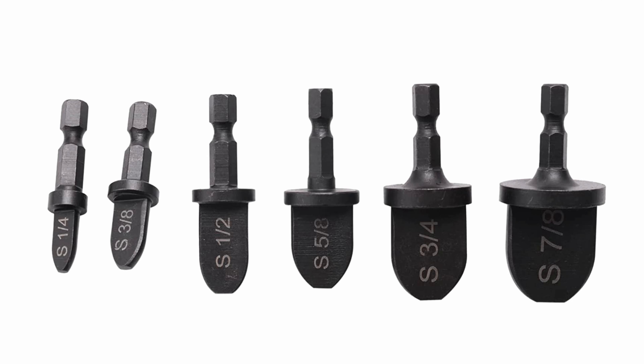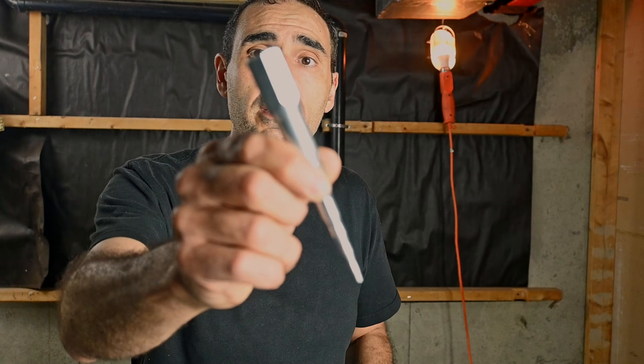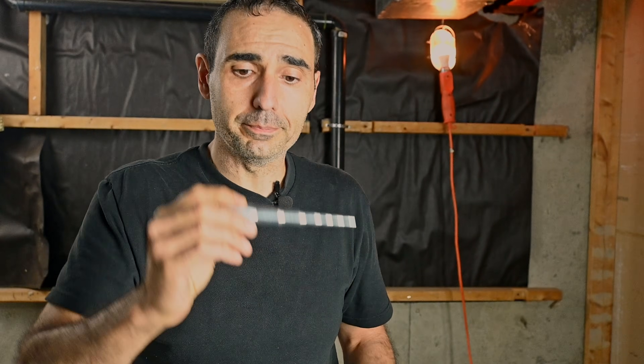There are different kinds of tools and methods for swaging copper pipe. You can buy drill bits that expand the pipe to a certain size. They have special expanders as well. But probably the simplest one we're going to demonstrate today is a punch-type step expander that will do several different sizes — in this case, up to half inch in diameter. A step-type punch expander is probably the most cost-effective way to swage copper pipe. It's about 10 bucks at the local big box store or hardware store.